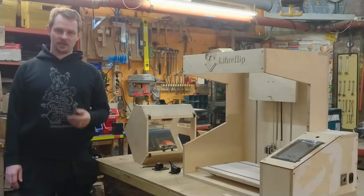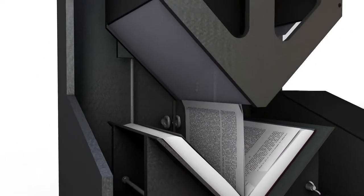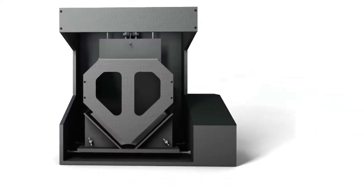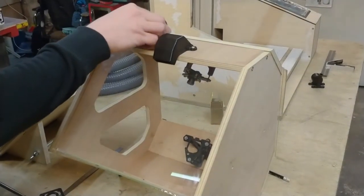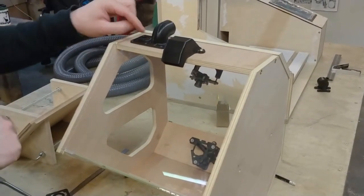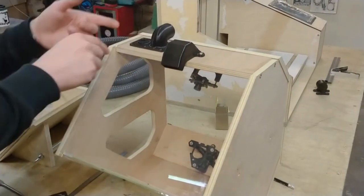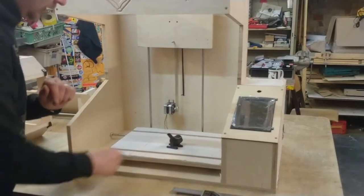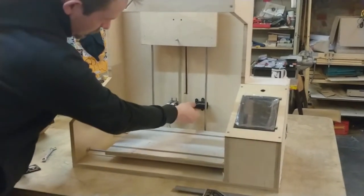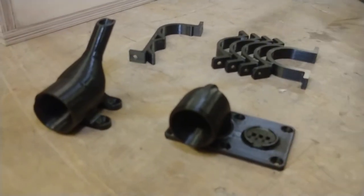Today we will mount the suction and the blowing tubes and connectors. This is the suction box, and today we'll mount this part, which attaches here and allows for the cables to go inside of the suction box and for the tube to suck out the air to connect to this. Today I will also mount the small nozzle, which will be mounted here and will give the pages an impulse to flip over. These parts are what I'm going to mount today.